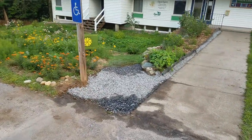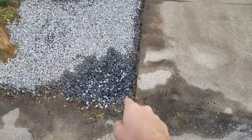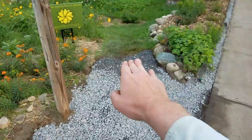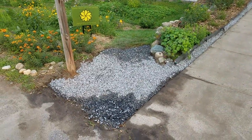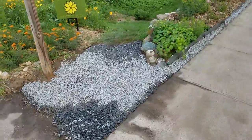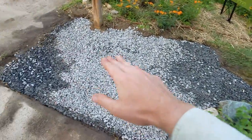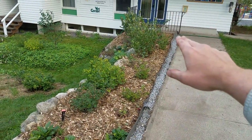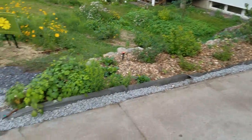As you can see, where the wet stone is — that's where we had our water coming in from the rain barrel. It migrated to here and then a little bit also migrated further down and soaked along there. You can see where that wet stone is, that's where it's starting to soak down into the path that way. I would say this has been a success. I'm really excited to see it during a rain event and see how the water moves through it. As we were doing it we were able to witness the water evenly fill up this entire trench, all the way into here, and the water started to migrate over here just as we expected — about an inch below the low point over there. We shouldn't be having any more issues and we should be harvesting quite a bit of rainwater.